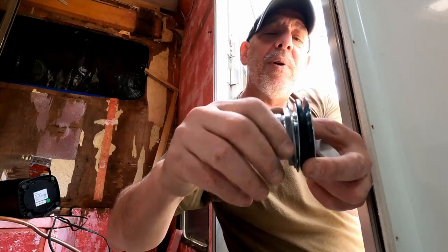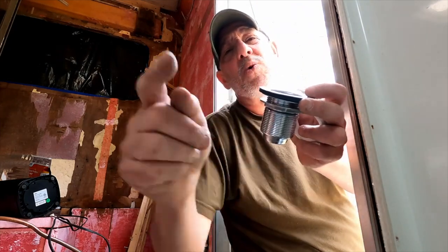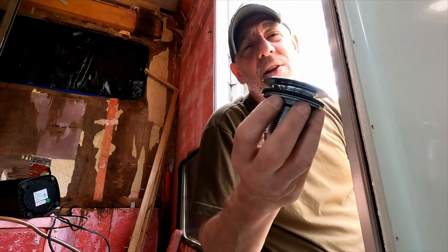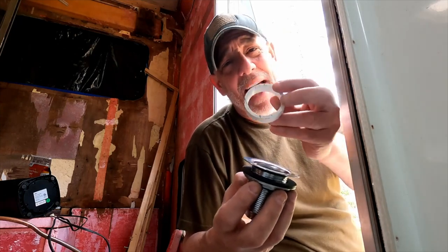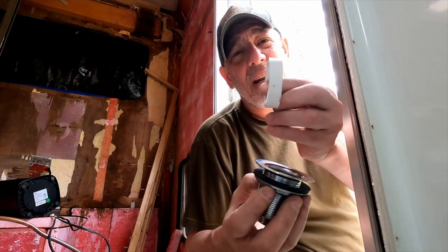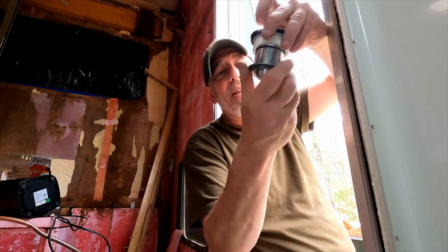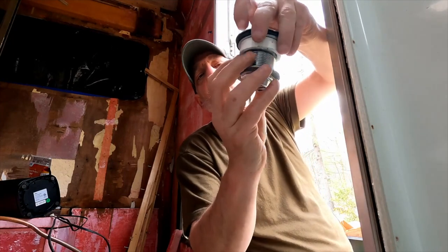What happens is you have to jump across and go to the next set of threads right there. The problem is this thickness is not close enough to the bottom of the fiberglass shower, so the nut falls right into this void where I can't tighten it. I had a little dilemma. What I did was take a piece of one-and-a-half-inch PVC coupler and cut it to about a half inch wide, so the bezel nut under that will make up that distance and cover the threads.